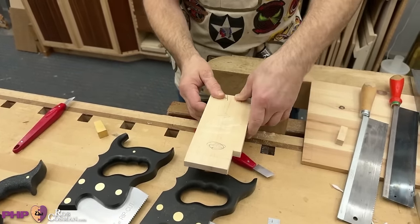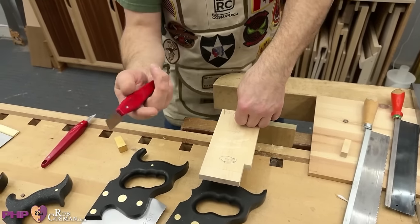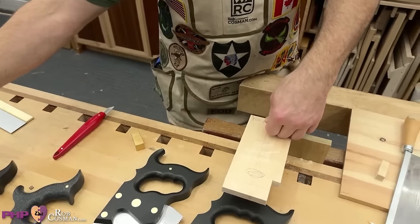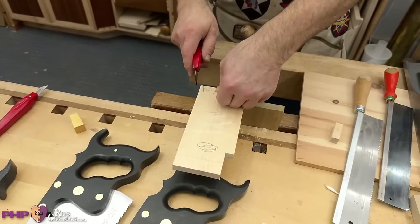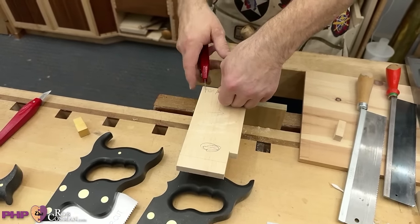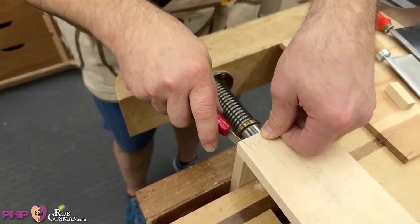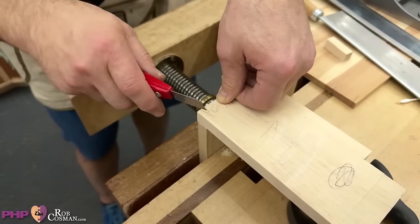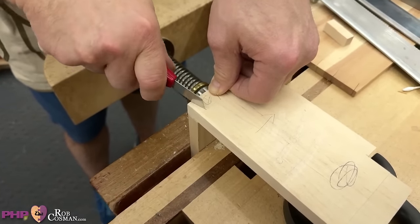Now that's securely held. This dovetail mark knife has a blade in it that is the exact same thickness as that dovetail saw that I just used. So when I put this blade down in there, see how it just fits? It can't move left or right. It can only follow the cut. Now, I'm not going to explain all the which way you move it, but let's just tell you this. What that does is I drag that through